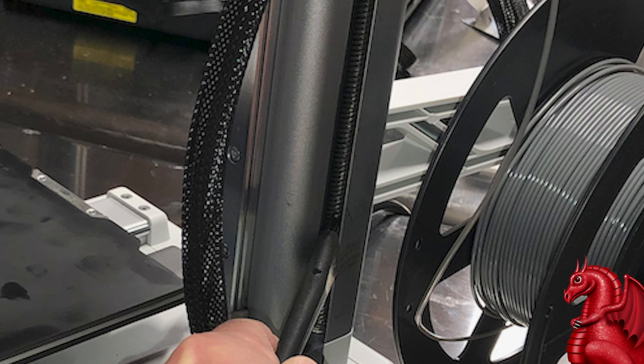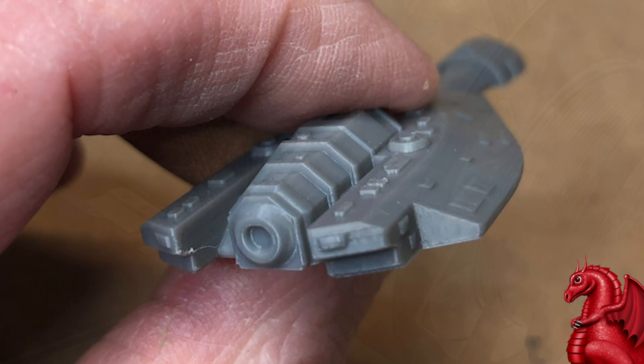The full-size A1 is easier — even though it's still hidden in the housings, the screw is directly opposite the openings, which makes it easier to get in with the brushes. From a maintenance point of view I really do like the Creality setup better, where the Z-axis screws are exposed. They get dirtier faster, but they're much easier and faster to clean. With these nylon brushes you will be able to get it cleaned out no problem, and the proof is right here in how much of a difference it makes keeping those Z-axis screws clean.